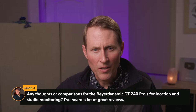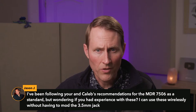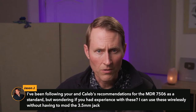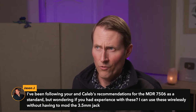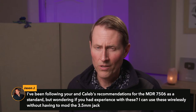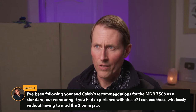Jason, any thoughts or comparisons for the Beyerdynamic DT240 Pros for location and studio monitoring? I've heard a lot of great reviews. I've been following your and Caleb's recommendation for the MDR7506 as a standard, but wondering if you had experience with these. I can use these wirelessly without having to mod the 3.5 millimeter jack. Are those wireless headphones? I don't know. I'd be careful with wireless headphones for production monitoring, and it's not so much for the reason most people would assume. It's not audio quality so much. That can be a factor, but latency is the bigger issue in my experience.